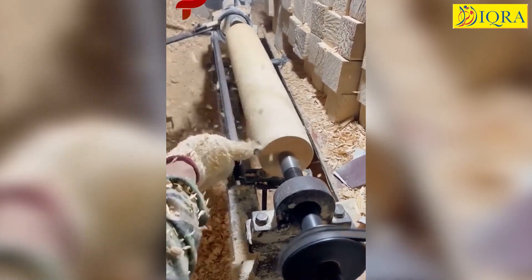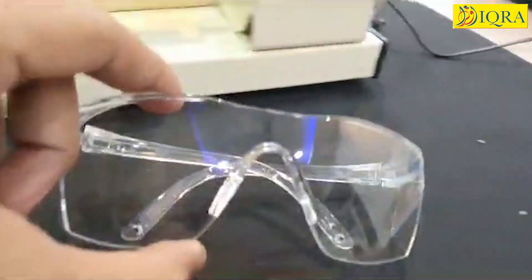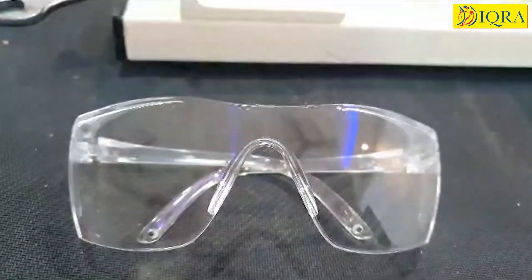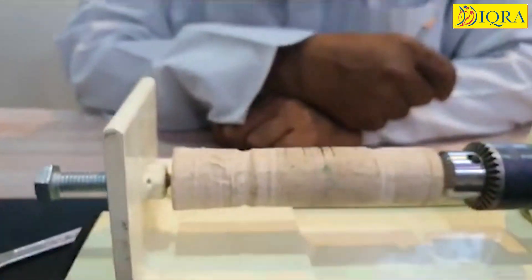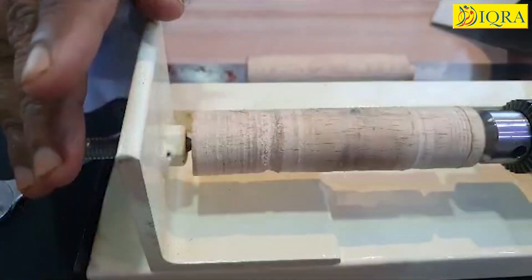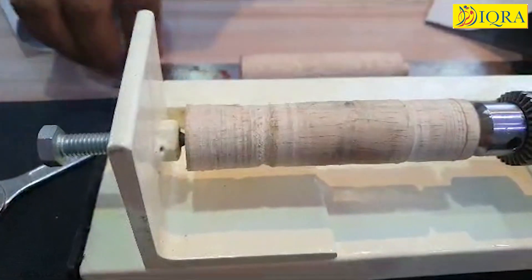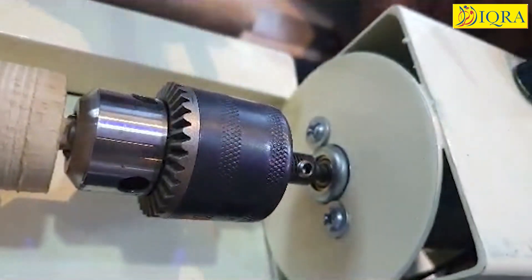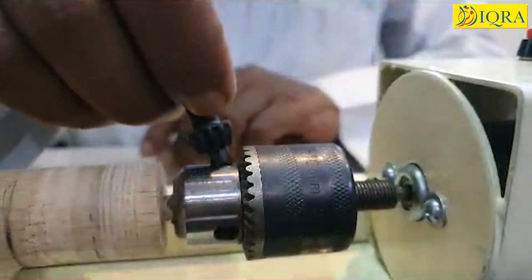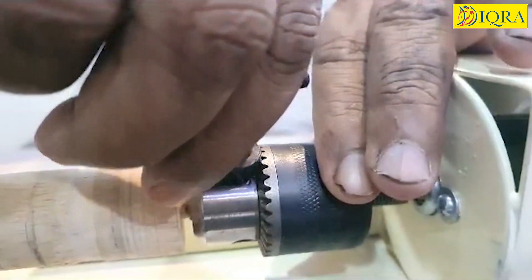You should use a safety goggle, wear shoes and an apron, and cover your hair. Girls' scarves should not be so loose that they get enrolled in the machine. The direction of the machine is such that the motor and the button should be on the left side of the operator. The tool should be held firmly and very tightly.